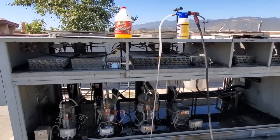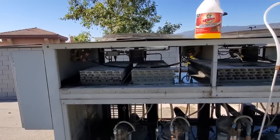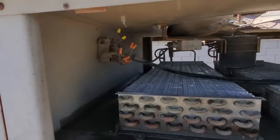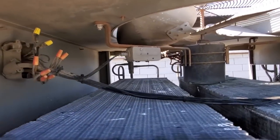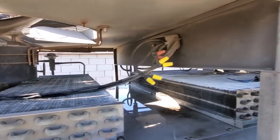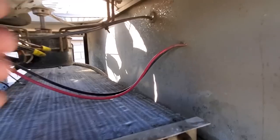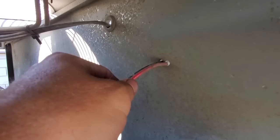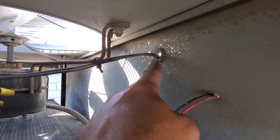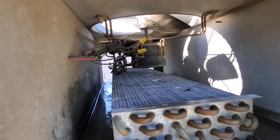Cleaning a refrigeration rack today. Like in my other videos, I always like to open up the panels to make my job easier instead of trying to fight it. This particular rack pulls air up from the bottom and blows out the top. Look at this wiring from the previous company — this spaghetti wiring, it's like a lamp cable, not even rated. And look at this — they drilled two individual holes for these two wires when there's a rubber grommet right there. What idiot did this? That's just nuts.